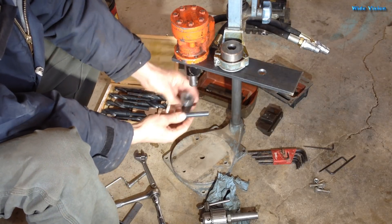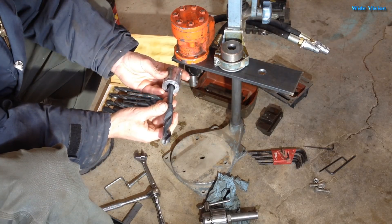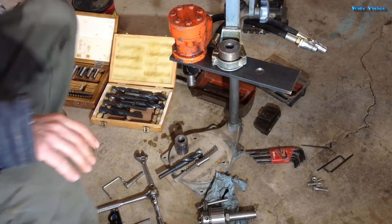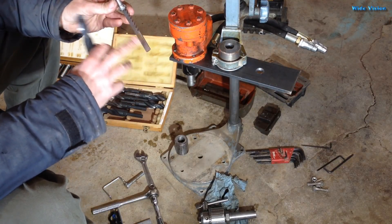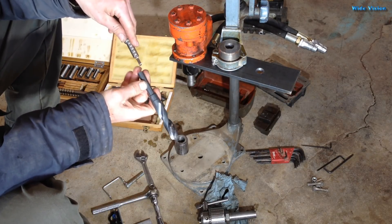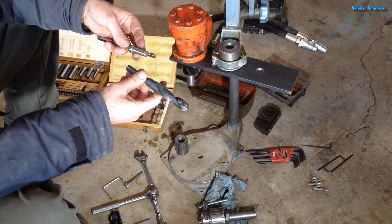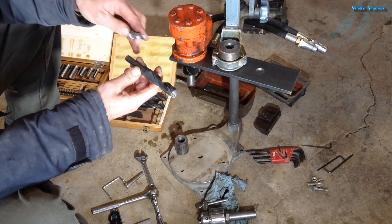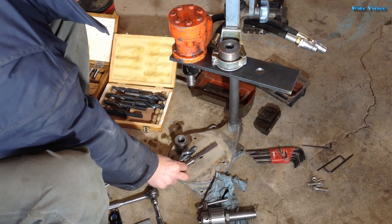So I'm going to make this adapter and then just drill a half-inch hole in it, then I can put these drill bits right in there. I was wondering if I couldn't use the keyway to lock it down so it clamps on that flat side. My broaching set does go down to one half, and the three-sixteenths broach fits in the half-inch socket — and a three-sixteenths key is as wide as the flat on this half-inch drill bit. So I'm going to put a half-inch hole in that, slot it for a keyway, put in a couple allen screws, and have that keyway push on that flat. Think that'll work — we'll give it a shot.